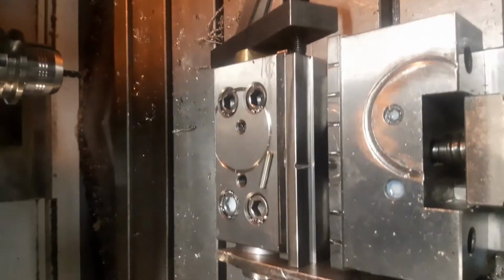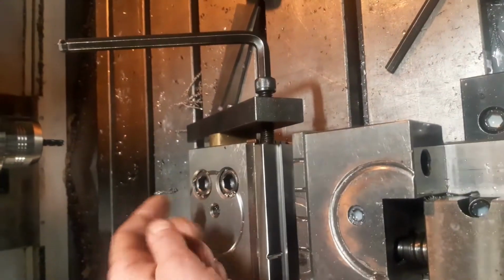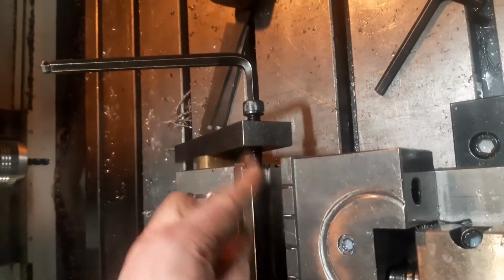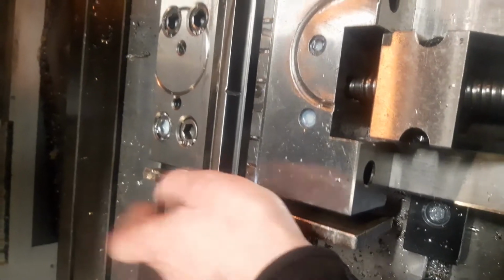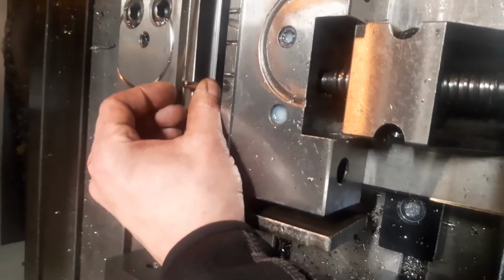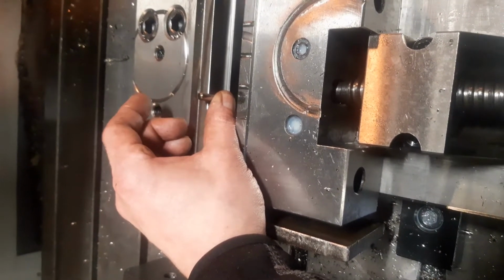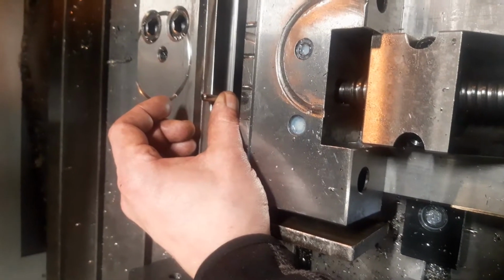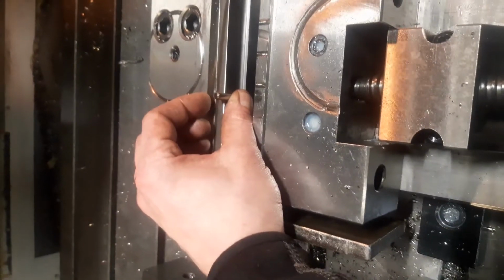for just a few pins, but I've come to learn that if you're careful with the rig in the beginning, it pays off in the end. And as you see, that part screws this plate to that plate, so it won't move. So we have a fixed position for the track here, where we put the pin, and in this manner we can machine this. We can take the 0 point and we can machine a number of these. We can also use 8 millimeter pins. I think it should be possible.